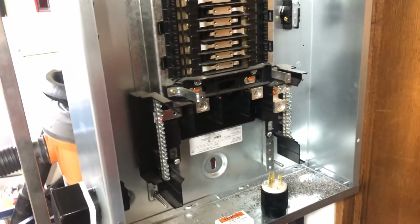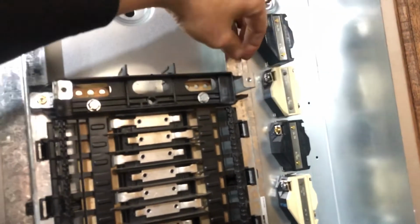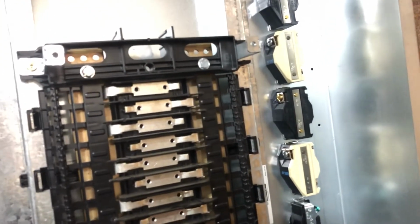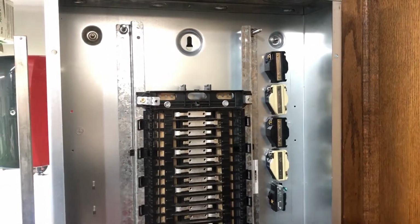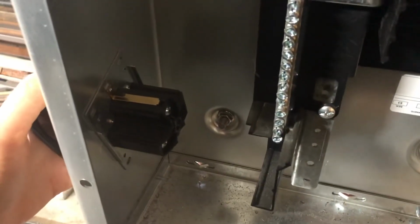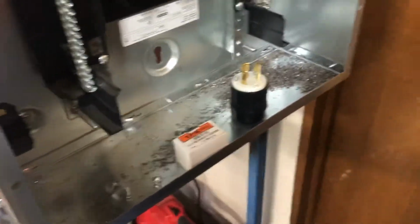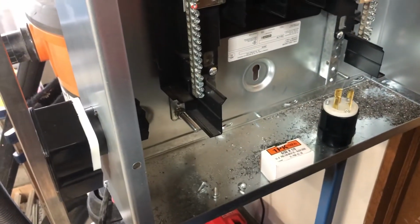This is a super industrial panel, and it allows large clearances in depth. This depth allows these devices to clear any wiring coming out of the circuit breakers at a different plane. And also it has a lot of extra width, so the can has plenty of space for mounting these devices. So anyway, that's going to be that. Oh, I'm also going to pull the bottom off. It's removable, and I'll cut all of the device holes in the bottom, which is where most of the stuff is going to come out of the bottom.